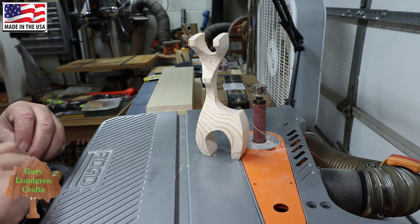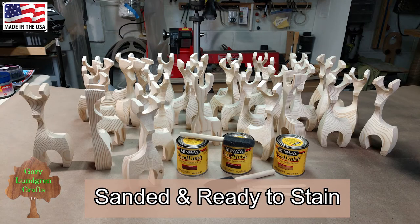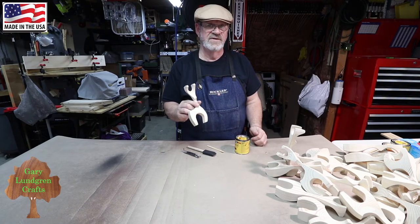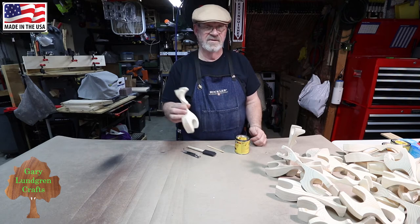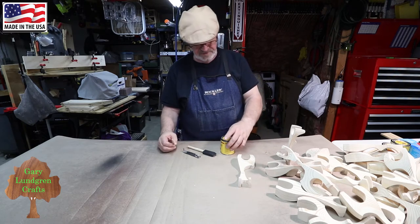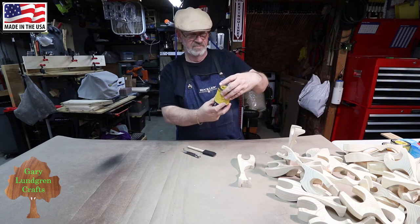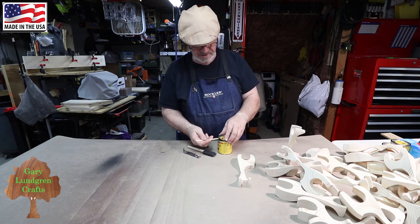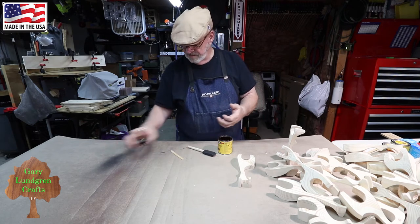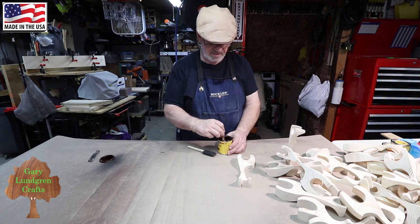Then you get a good reindeer. Next step will be staining and painting and doing some of the other parts. Now I've got all these sanded to final sanding so I can start finishing them. First thing I'm going to do is take a can of stain — whatever I happen to have available as long as it's kind of a dark brown. This one happens to be a red mahogany so that'll work, and I just pry this off with a can opener to get the lid off, then stir it up and get it mixed up well.